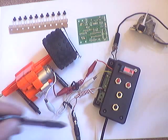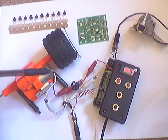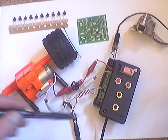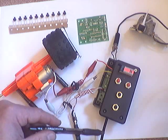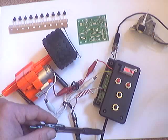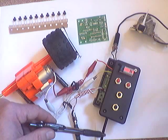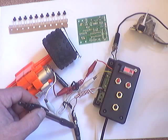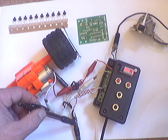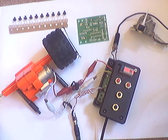You can supply this thing with external power, which is required if you're going to run 12-volt motors off of it. Or for small 5-volt motors, you can drive it with just USB power — recommended up to 200 milliamps maximum across the USB. This will take anywhere from 7-volt input to 15-volt input, and as you can see it can support quite a wide range of analog motors.